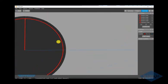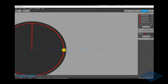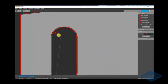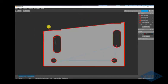If you zoom in, you can see the red line is offset from the solid of the part to show that the tool path is being offset by half of the tool diameter to account for the width of the stream. And we've got our leads on there, so we pierce in the scrap area and then lead into the cuts. If you want to change your lead position, you can just left click and change it.